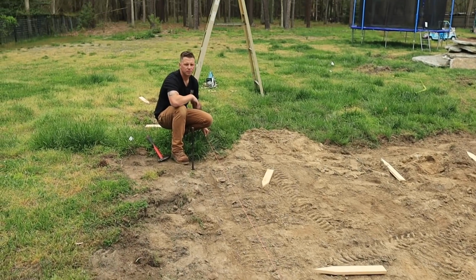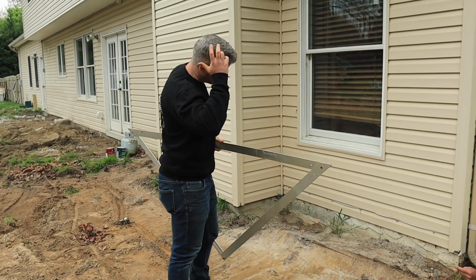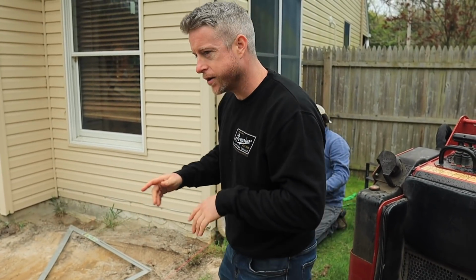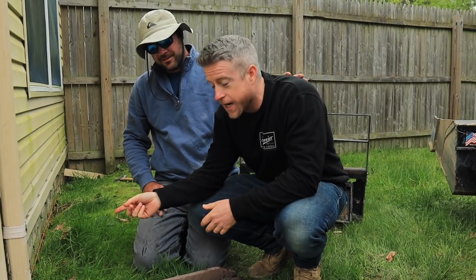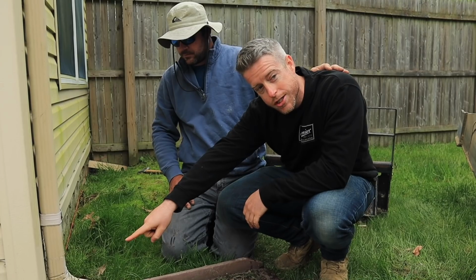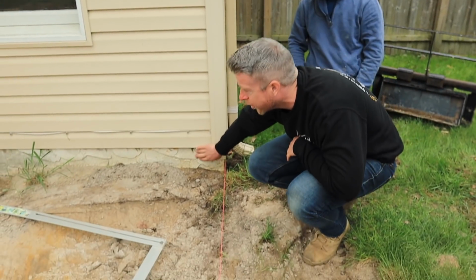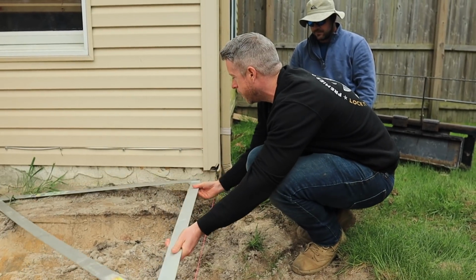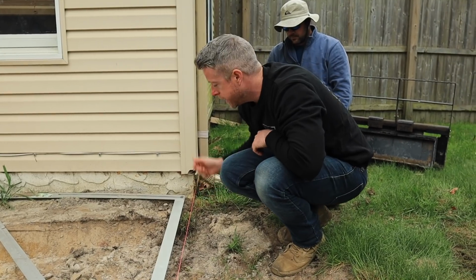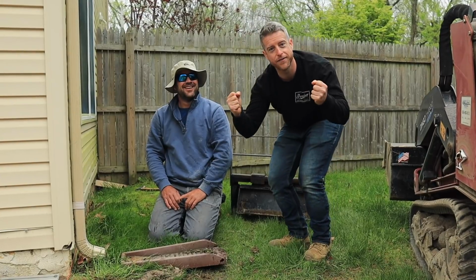We're gonna have to measure off of that. It's about 20 feet wide. Go that way a little bit. A little bit more. We're making sure we get this first line coming square off of the house. Get an extra stake. Couple different ways to do this. You can see he's got it pinned up against the foundation over there, and then just pulling away from it, and just make sure that it's just touching this corner, and that means we're coming out straight from the house. You can see we have a little bit of a texture on the wall here. So with our collapsible square, it's gonna be a little bit difficult to make sure that we're sitting on there nicely. So this is gonna be a little bit closer, and we'll double check it once we have all the strings ran to make sure everything's nice and square.